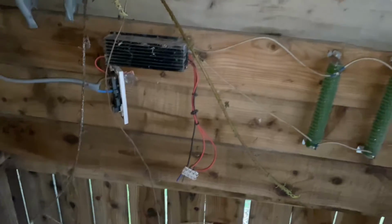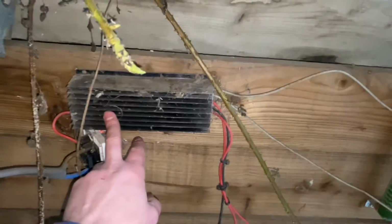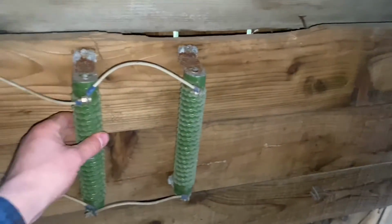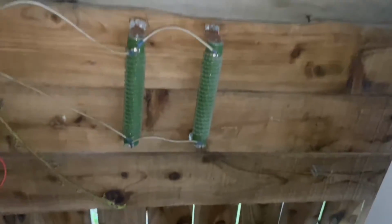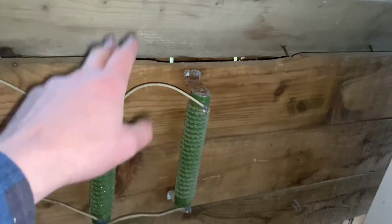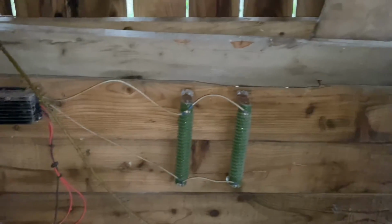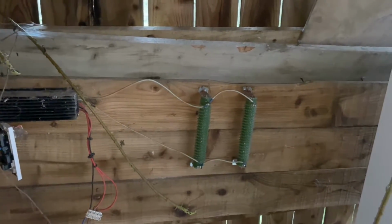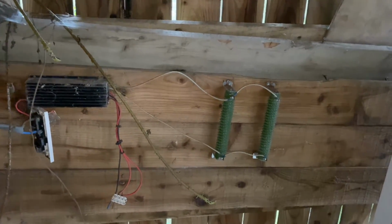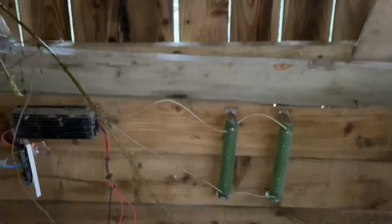I've actually, literally about a month ago, got rid of the solar panels that were on this roof. So there was a wind turbine and solar panels coming into this. And these wire wound resistors are our dump load, or were our dump load, just to get rid of heat. Now I know they shouldn't be screwed onto wood. It's a really bad idea, but they were working, and the system worked for years. Gosh, 6-7 years this system worked for. It did its job. We got rid of the heat, and the batteries didn't overcharge.